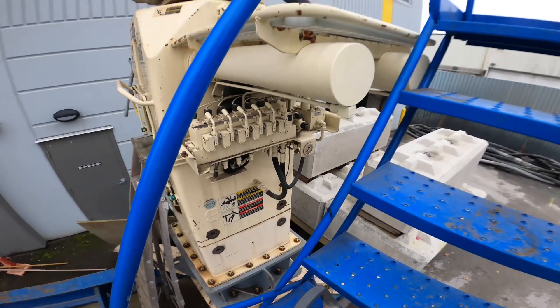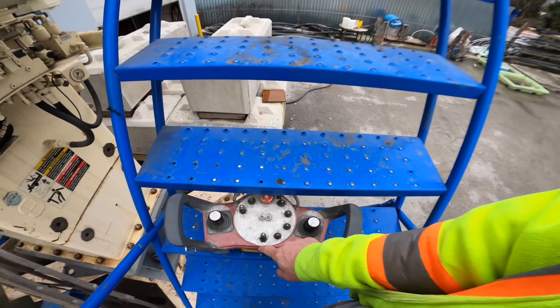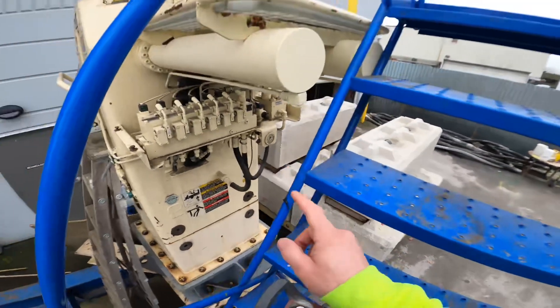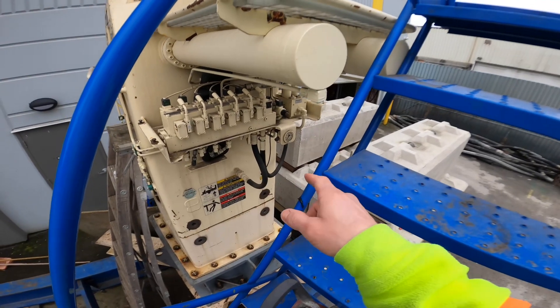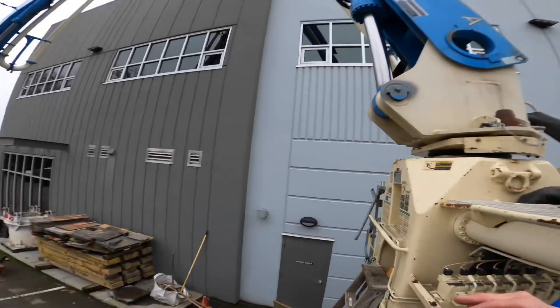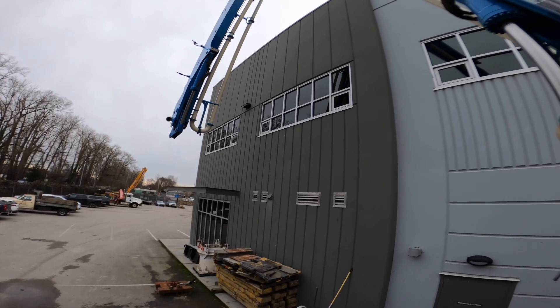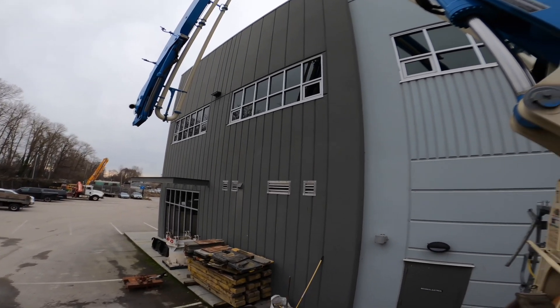That's actually pretty good. So what I'll do is go through all the boom sections the same way — set them in rabbit, then go to turtle and make sure they're all opening about halfway. I'll do that visual check to start with, and then I'll drop down and go by feel based on what the boom sections are actually doing speed-wise.